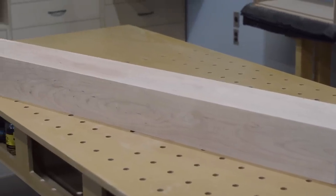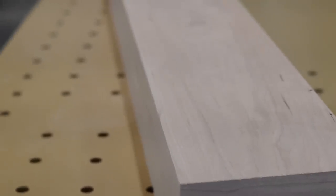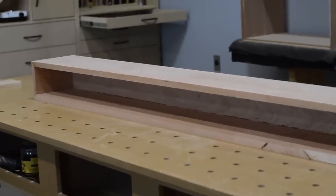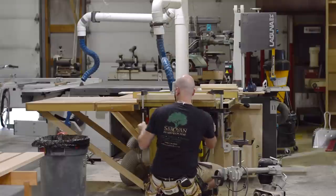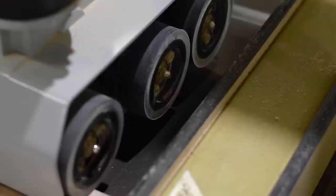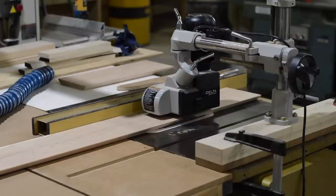Now it's time to make a really cool modern and sleek fireplace mantle. This mantle is really just a bunch of bevel joints glued together. Anytime you're going to cut long bevels on the table saw, a power feeder really makes this easy. The two challenges are consistent feed rate to avoid burning and consistent downward pressure — the power feeder takes care of both nicely.